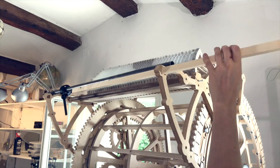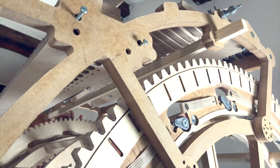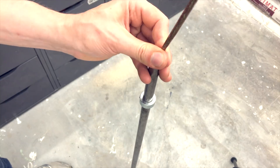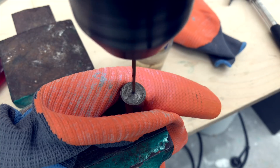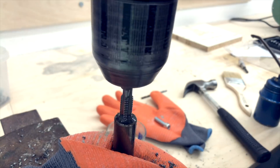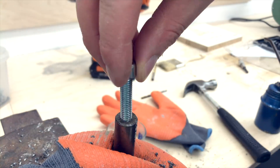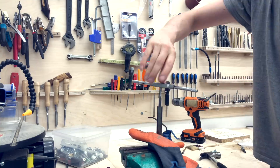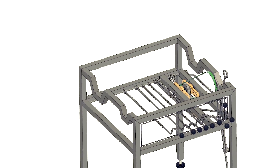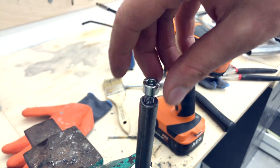Here I'm sawing two temporary shafts that will be replaced by square tubing later. It's for the muting system that rides on these two shafts. And this round 15 millimeter shaft that I'm working on is a pivot shaft that sits at the very base of the Marble Machine X and has a lot of levers pivoting on it - the levers for the brake of the flywheel, the clutch of the flywheel, and also the levers for the mechanical rhythm machine.